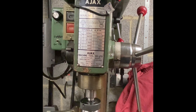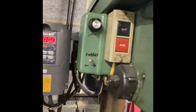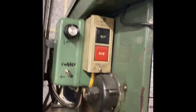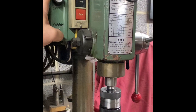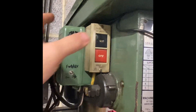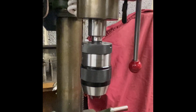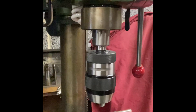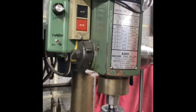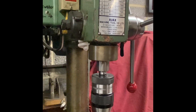The other things I did: I incorporated the controls into the existing switches on the machine. So the machine runs and stops using the existing controls. The other thing is, with the variable frequency drive, I've also got the option of forward and reverse. I can click that while it's running and it will stop and then reverse the chuck. This is good for tapping and various operations like that. There's no need to stop the chuck when you're forward and reversing, and that's all digitally controlled by the inverter, which is a fantastic piece of kit.